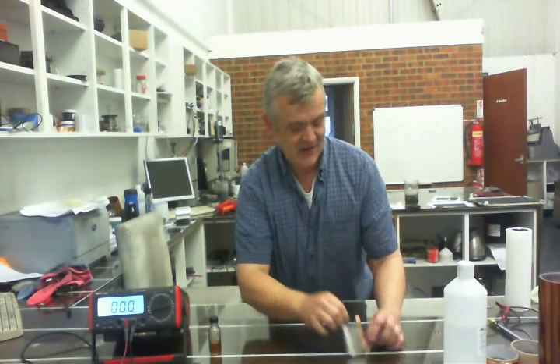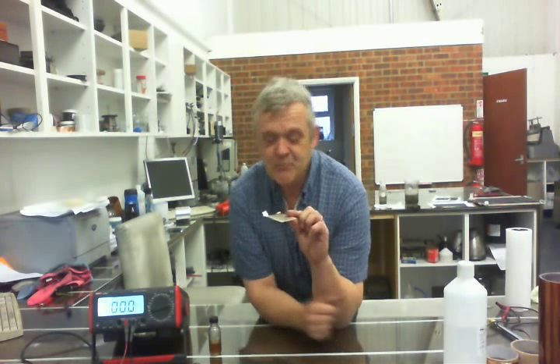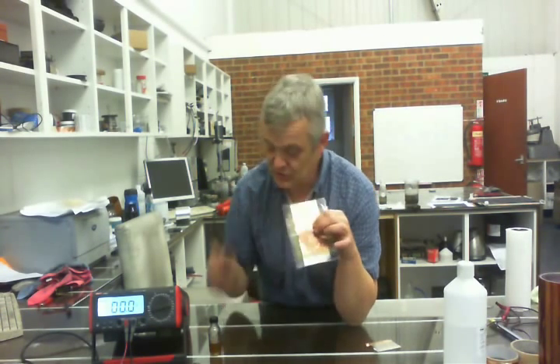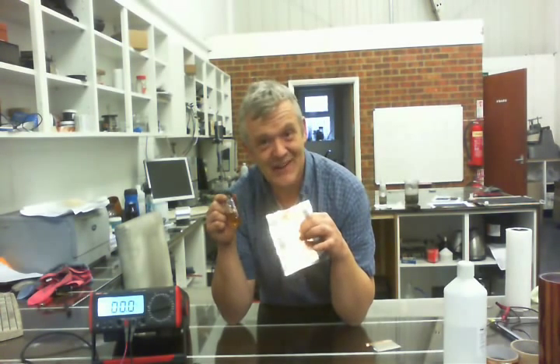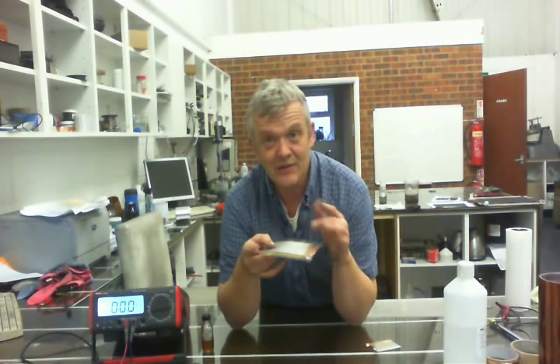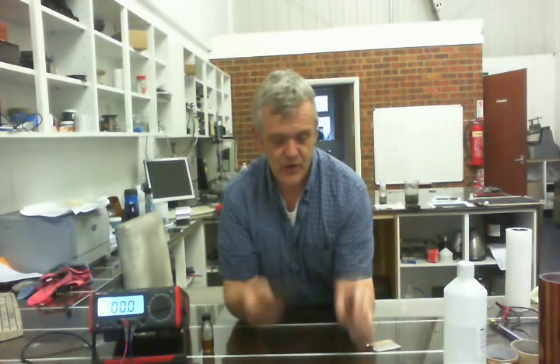We extract this from a leaf and turn it into a solar cell — and here it is. One interesting thing is the use of copper and aluminium: two different metals with an electrolyte between them. The first thing you'd think is, hey, that's a battery. So to offset that, I made a battery setup — a large aluminium plate, a large copper plate, a paper towel soaked in Mysterious Leaf Extract 1 between them. If it's a battery, we'd expect some kind of reading.